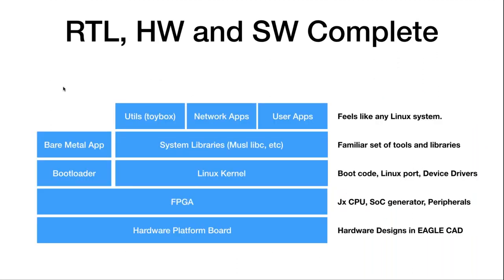Lattice, which has the fully open-sourced toolchain, is now making larger FPGAs — though much slower than Xilinx in terms of clock speed. Even a 33 MHz processor is how fast Linus Torvalds' machine was when he first wrote Linux. We don't necessarily need other vendors to stop being proprietary with their toolchain because multiple fronts are advancing in parallel and opening up. The entire ecosystem is here — all the way from hardware boards with open reference designs you can clone and modify, through to user space applications and utilities.